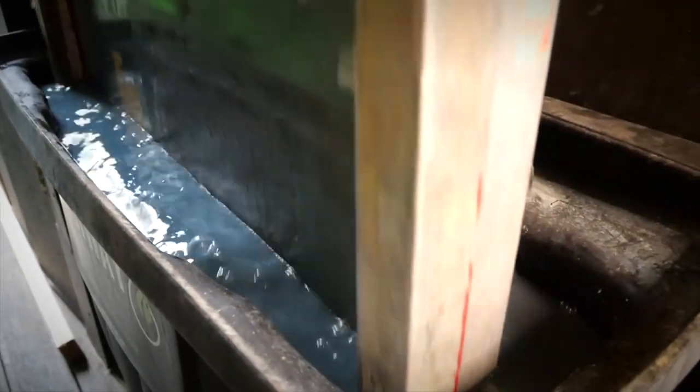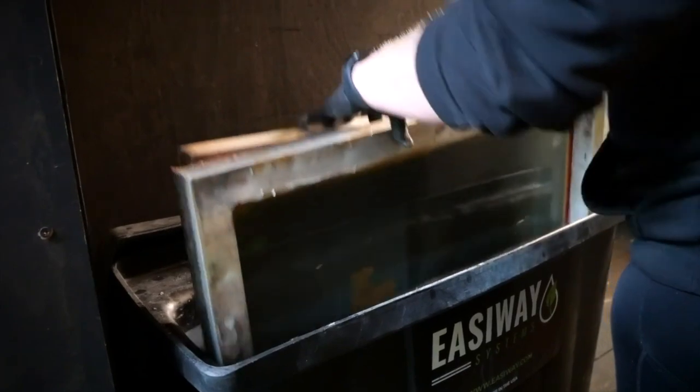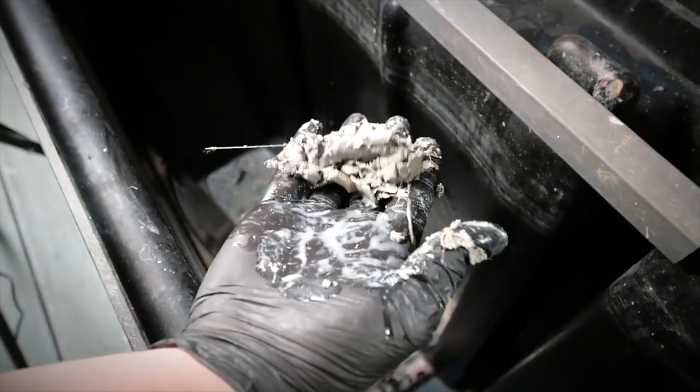that when you're using static frames, they're hollow aluminium frames and they actually float in the dip tank, which is quite handy actually, because then they're not getting sludge and muck on them when they're just being decoated in the dip tank. So we did find that the eco snap frames didn't float and they were so heavy that they actually sunk to the bottom of the dip tank. If you had a flat bottom dip tank, they would get covered in sludge and muck and it would just be another thing to clean and get into your production. It would be a bit of a nightmare.